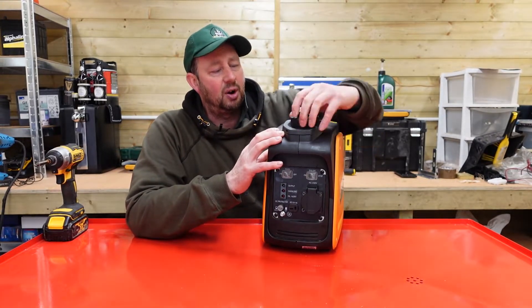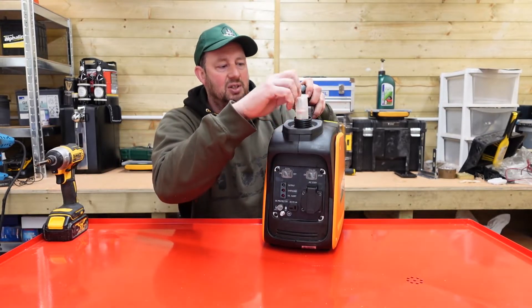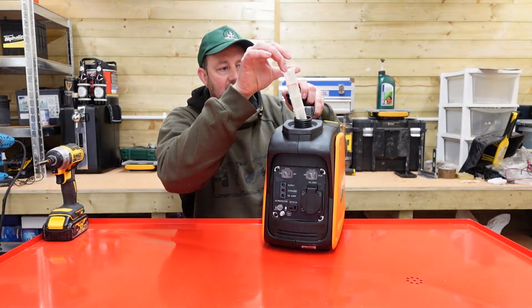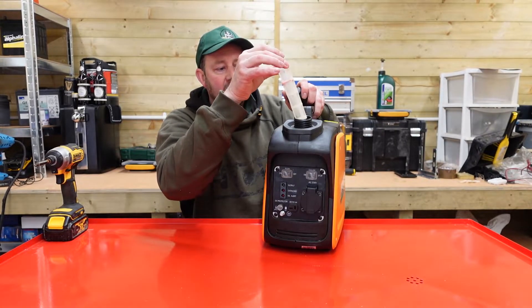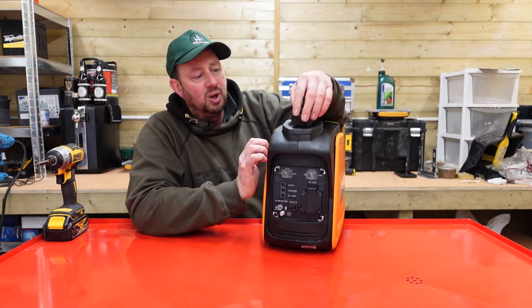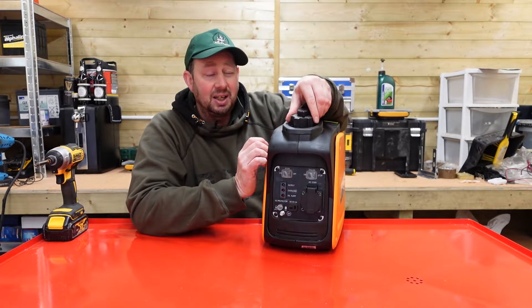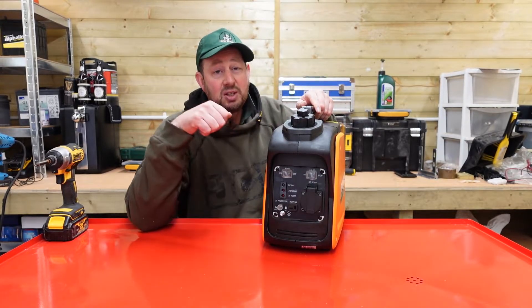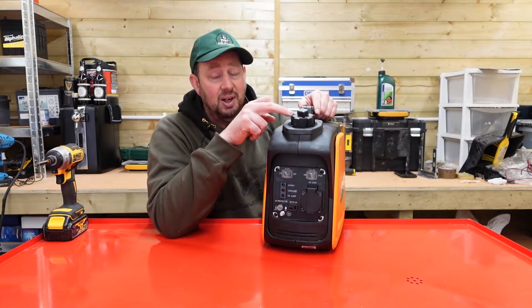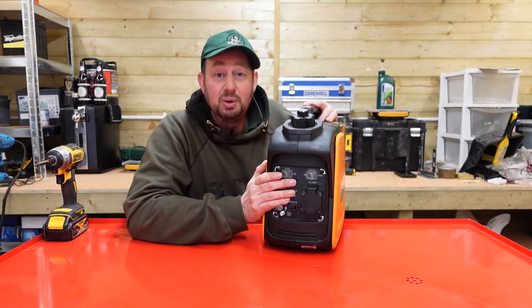The second thing: if I can open the lid, there is a fuel filter inside. Ours is nice and clean all the way around. When you're fuelling the machine, just be mindful that the fuel you're putting in needs to come from a clean container. You can't fill it up at the pump because it's not big enough, so you have to put it in a container first. Make sure you've got a clean container and it goes in through a clean filter and then into the tank — and that's as much as you can do.